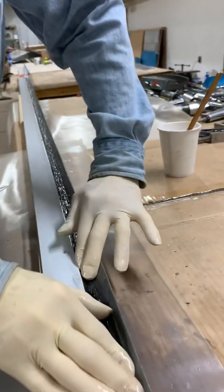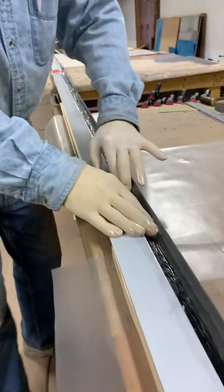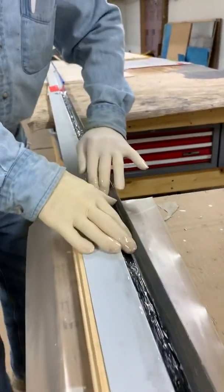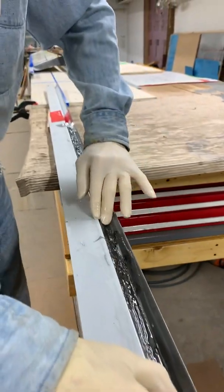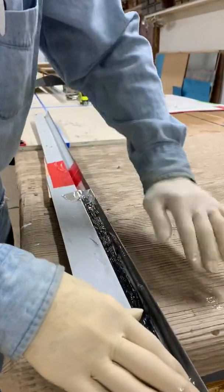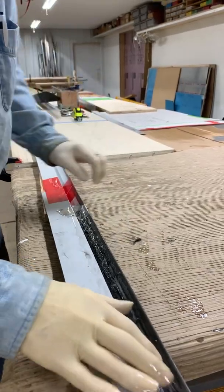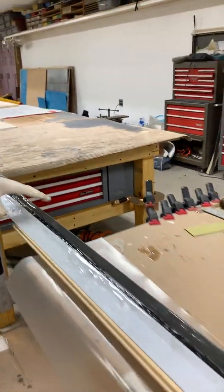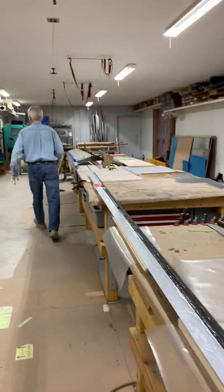I'd like to put the rivets in after it's been set up, so it's your primary structural finish on the control surface. You just take your finger and run down here, squeegee out any excess resin — and that's handy because you're also forcing it down into that D and it comes right out.